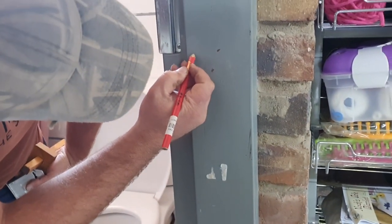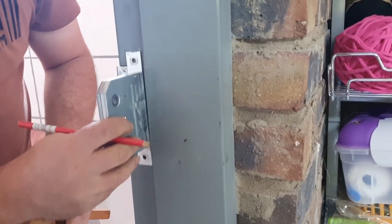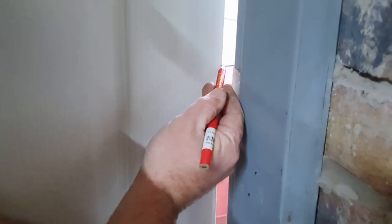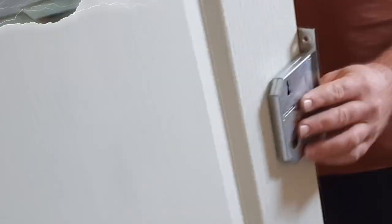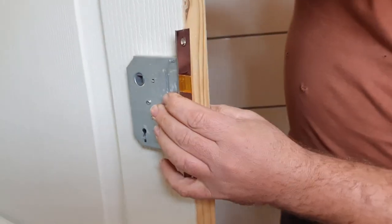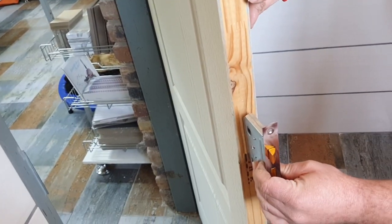Now we are going to do a rough mark — we have to see where your striker is going to be, so you don't go too high or too low. We are going to mark it roughly here, then we're going to close the door and make a mark on the door to tell us our height. There we are — we have a mark. If you look here on the side, when you have a brand new door it will indicate on the side where we are going to carve out the small block and put in our lock. Now we just line up along the marks and estimate where it should be, and I'm going to start making the marks.